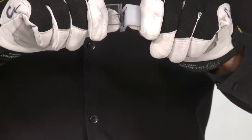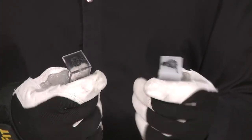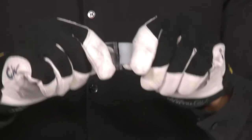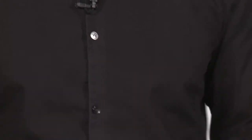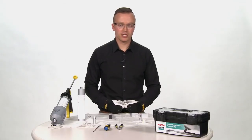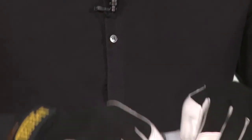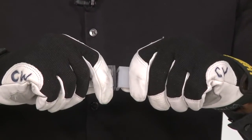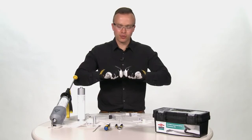It is possible to rework the material right away. Whereas with a fully cured sample, you have much more strength. If some adjustment is needed, it is possible to reheat the substrates to allow for easy reworkability for up to 24 hours. Because of the moisture content of almost all substrates, reheating weakens the adhesion and allows for easy reworkability. When demonstrating reworkability and reassembling the substrates, it is important to apply some force to allow the material to re-wet the surfaces.